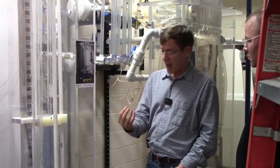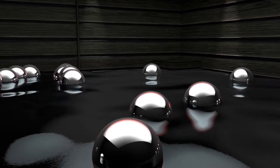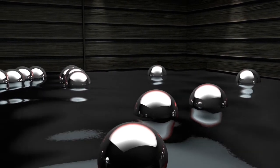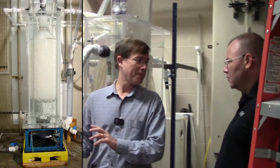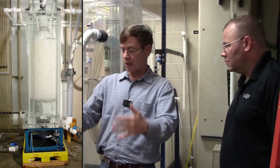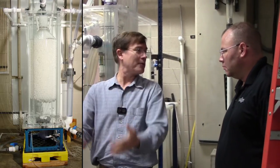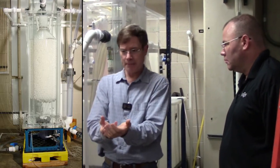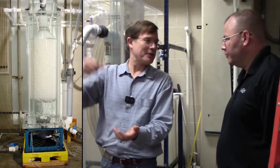But with our system, everything's buoyant, almost neutrally so. So the pebbles are very light, so to speak. With molten salt coolant, graphite is less dense than salt and floats, and therefore fuel elements want to float. We realize that it might be an advantage that the fuel floats if you have pebbles, because in a salt-cooled reactor, you want to have the coolant in a vessel that has no openings around the bottom. That is a pool type of configuration, which means you don't want to take the fuel out from the bottom of the reactor, right? You want to take it from the top.